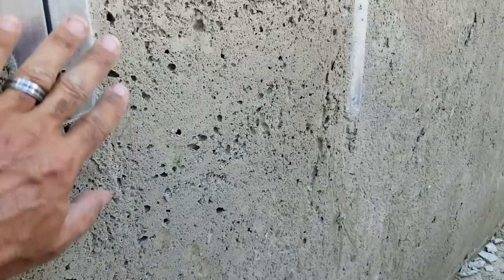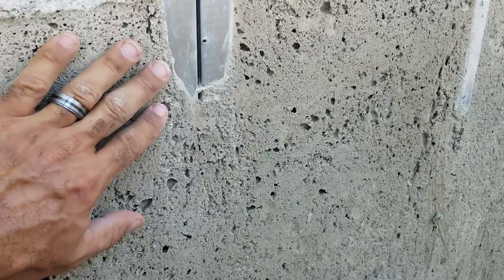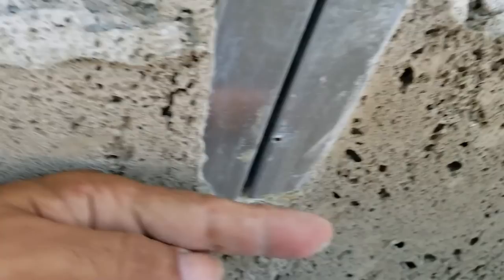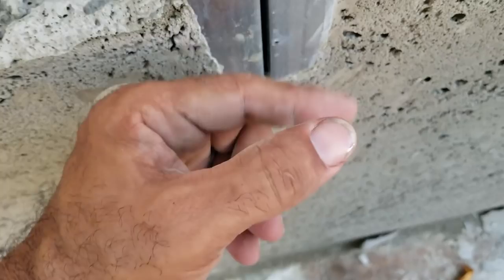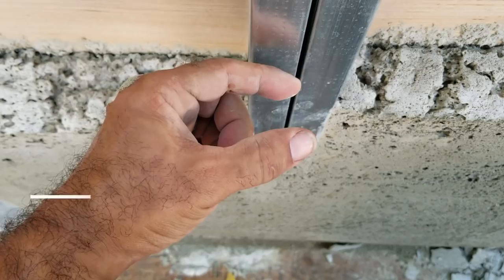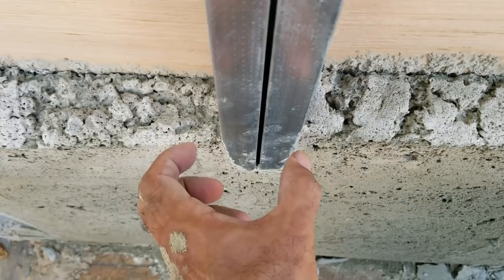This was a quick test. Ideally, if I were going to be building a wall using steel studs and aircrete, I would want to have a gap between the steel stud and the form of at least one inch, so you'd have one inch of aircrete insulation between the studs on the inside surface. On the outside I would want to do the same thing. A simple way to do it is to make aircrete spacers — one-inch-thick aircrete slabs cut into spacers — put them in place, put your panel up against that, and put your screw through it, and then you'll have the gap you need.